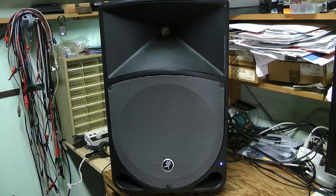I am almost sure I know what's going on here. Most probably the woofer is damaged — it happens when the speaker is run at very high volumes for a long time, essentially overloaded. The voice coil in the woofer overheats and develops shorts between the turns. Depending on how many turns are shorted, the problem can be very pronounced like in this case. So I guess we will find that the resistance of the voice coil is much lower than it should be — let's say less than half.